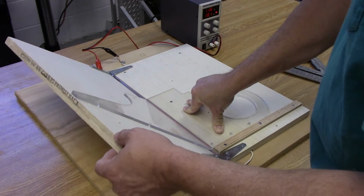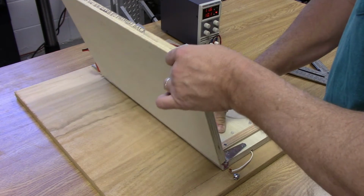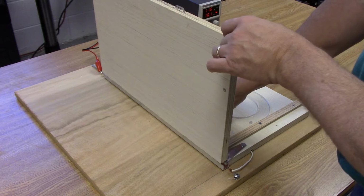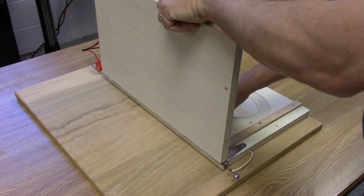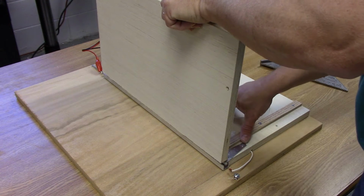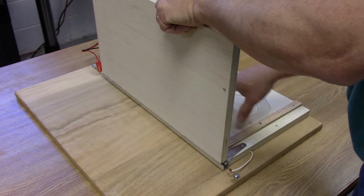The acrylic needs to be bent at a 90-degree angle. It could also be cut into 2 pieces and glued together, but I prefer the cleaner method of bending the acrylic. I used a shop-built acrylic bending jig. There are a lot of tutorials on how to build one of these very easily with a piece of resistance wire, so I'll leave that up to those videos.